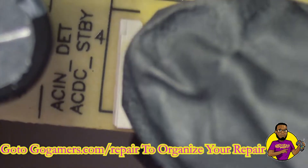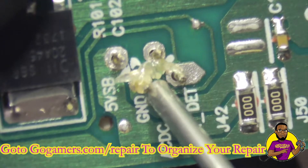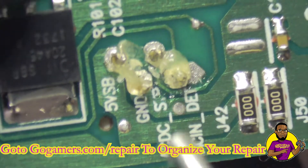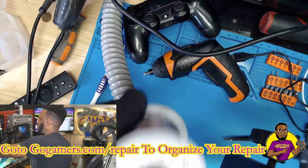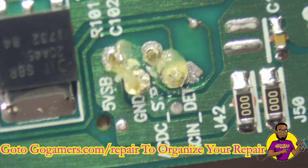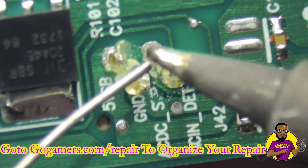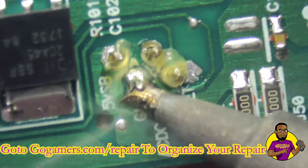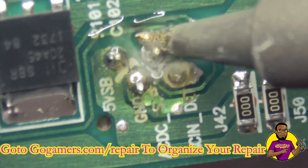I got it in there. Now we need to get the solder into place, so we go right back underneath. As you can see, we have all the pads sticking out from the other side. We're going to apply flux and take our solder wire — everything I use is listed in the description below. Now we're going to hit every single point, just touch it and let the solder flow on nicely using that flux.